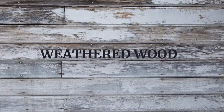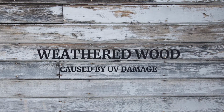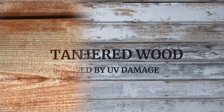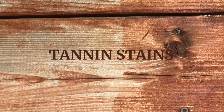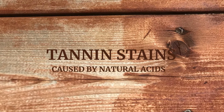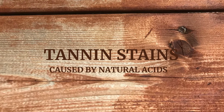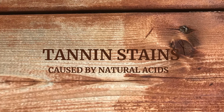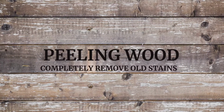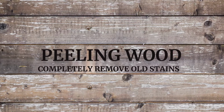If you notice gray weathered wood, that's UV damage, and it's made the wood fibers loose. Remove the weathered surface before staining. Tannin stains are reddish-brown stains that occur when moisture draws natural acids to the wood surface. Remove the stains with oxalic acid or an oxalic-based solution. Look for old peeling surfaces and completely remove any failing stains or finishes to make way for new coatings.